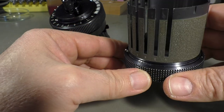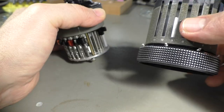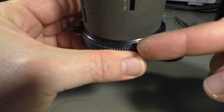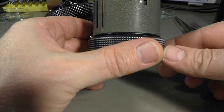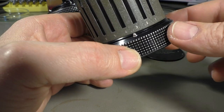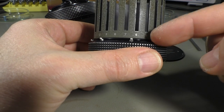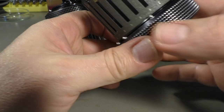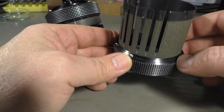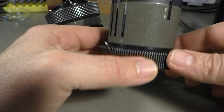And these little dots are, in fact, one of the reasons why I didn't want to disassemble the entire mechanism. Because just out of curiosity, I removed that screw here. Then you can take out these dots. And inside the dots, you see how small they are. They have probably 1 or 2 millimeters in diameter. There is a spring inside and a little steel ball that presses down on the surface so they won't move by themselves. They are held by this spring and ball force here. And to get it back into this rail, it literally took me half an hour for one dot.